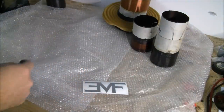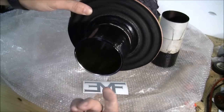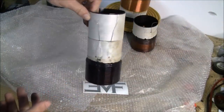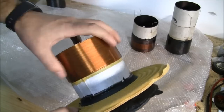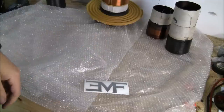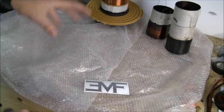This is another example of a very, very dark coil that is perfectly fine — nothing wrong with it, no ripples, no bubbles, no broken marks. This was burped on a lot of power and then torn down, but the coil is fine. These are all examples of clean power — even with some uneven coloring, there are no bubbles, no ripples, no holes. We can tell how you've used the sub. So if you send it in for warranty and say you only had half of rated power, we can look at the coil and say no, that's not what happened.